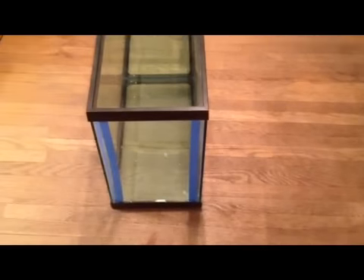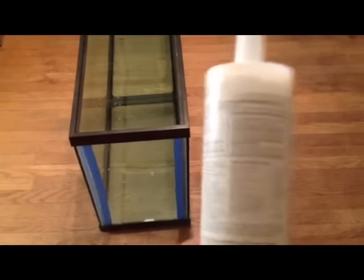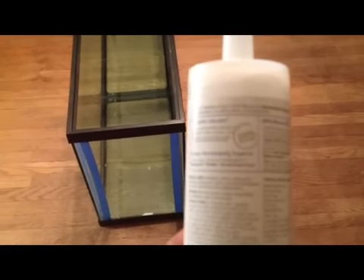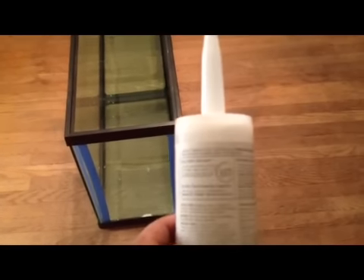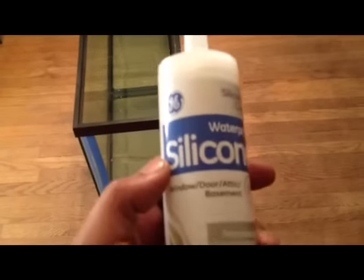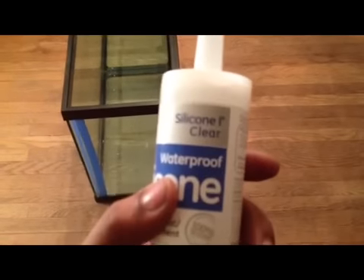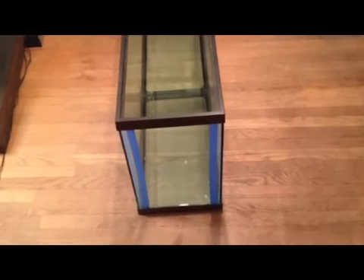But straight lines up the corners you are going to see, so I got a GE silicone one. You want to look for — it says 100% silicone. If you don't buy this brand you want that 100% silicone somewhere on the tube. If it says mildew or anything like that it is not going to be safe. So window, door, attic — silicone one. Alright, I am going to get to sealing this and I will show you when I am finished.